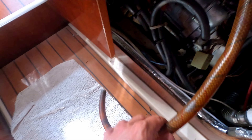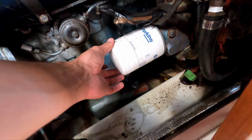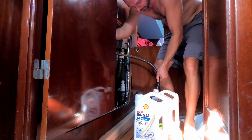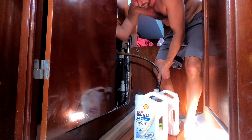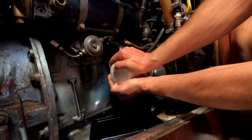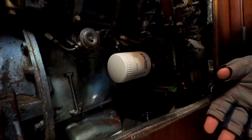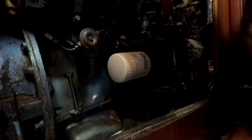It's been about nine or ten months since I did the oil change — can't hurt to do more frequent oil changes. This is the oil siphon hose, and amazingly this engine comes with a pump so you just pump it up and down to pump the oil out — you don't have to drain it from the bottom. Then once that's done, here's the oil filter — I'm going to remove that, some extra oil will fall out, and replace the filter. Why don't they build all engines with a pump built in, especially marine engines? My last one did not have a pump. That's the plan — container underneath to catch the oil. Sailing gloves for the win — barely did it and saved me from having to get my strap wrench.